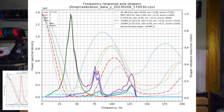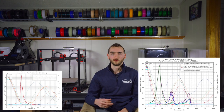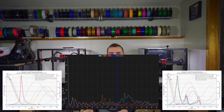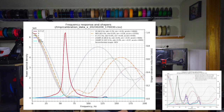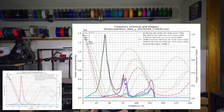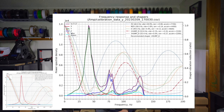There's a lot of useful information embedded in these graphs, and we can learn a lot about our printer by inspecting them. This is one aspect of Klipper firmware that I prefer over RepRap. RepRap just gives you the raw data without any analysis. Klipper will plot the data for you and fit the different shaping functions to it, then give you a recommendation of which function and frequency yields the biggest reduction in vibrations. Depending on the appearance of the shaper graphs, you may also notice other issues with your printer. This serves as a great diagnostic tool and is one of the benefits of this process beyond simply configuring input shaping.